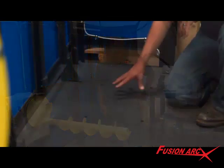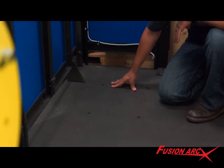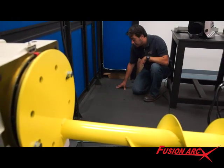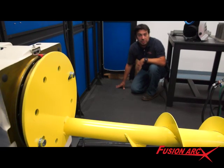As you can see, this system opted for the versatility package. Laser-cut holes with weld nuts on the back side of the floor allow for adding peripheral access later easily. So we can take a headstock and pedestal and relocate it over here quickly. No drilling, tapping, grinding, cutting, or repainting is necessary — it's all dropped in place.